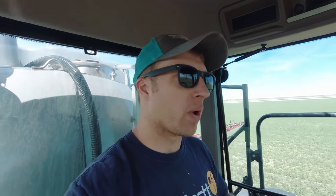Another thing that I'm not 100% sold on is the hydrostatic drive. Now, disclaimer, all of our sprayers are mechanically driven with power shift transmissions. I like that because I feel the power go to the wheels. I can regulate the speed based on the engine RPMs. I know it's nice to have the engine maintain one speed, because then your hydraulic pumps are running one speed, which is maintaining the hydraulic flow at one speed, and that works better for a sprayer. But all things aside, the hydrostatic drive, it whines a little bit.